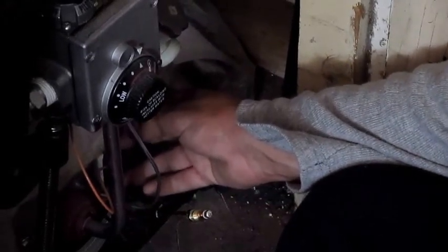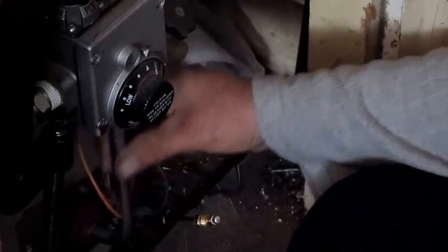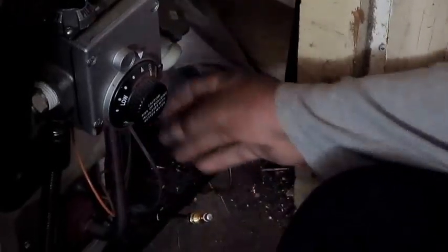I'm going to turn it off for a second while I take these two nuts off and take the main gas tube off here and the pilot light tube here. I'm going to disconnect all these, take the two bolts off, and pull this whole assembly out. Then I'm going to turn the camera back on. Okay, I'm back. I took it off — everything's taken apart. This is the burner assembly here.